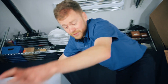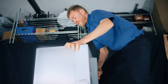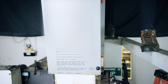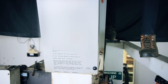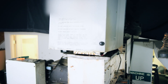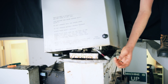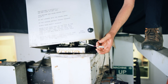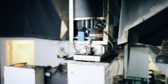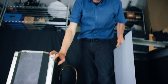Let's act like we have sheet metal here. I'm going to pull the head cover up and keep pulling up. Now I'm tilting it over, but I've got to clear the sheet metal. You want the head jogged all the way up. As soon as I clear that button in the imaginary sheet metal, I can push it out and I'm totally clear. Also, I have this connected — you're going to have to reach down and pull this apart, or you can push it up an inch or two and disconnect it. Don't forget to disconnect the tool release switch. Pulling the head cover forward — if there was sheet metal here, I would just sit it right on the sheet metal. Now it's time to get into the head.